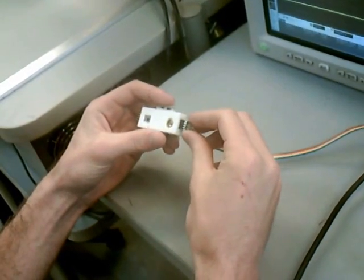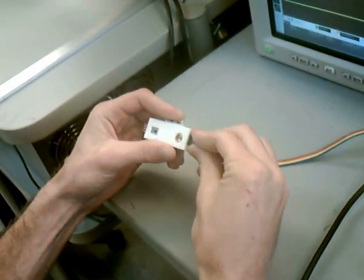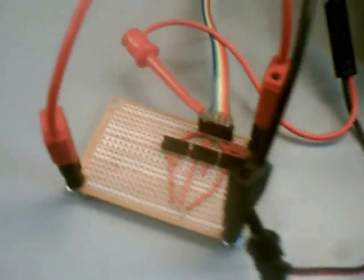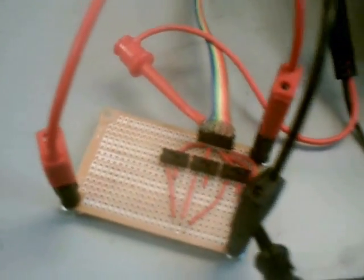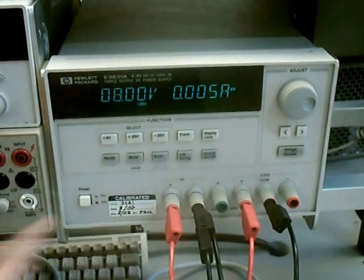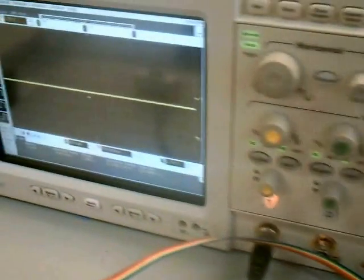The basic test setup and proof of concept has been completed to show that the module is able to detect changes in oxygen levels in the blood. The wavelengths are controlled by this simple switchboard, which also supplies power to the photodetector. The power supply is adjusted to provide a constant 5 volts to the photodetector and is used as a constant current source to provide 50 milliamps to any of the three LEDs, which have different operating voltages. The output of the photodetector is amplified with gains between 2 and 20, depending on the test subject, so that small changes in voltage can be monitored. This signal can be viewed on an oscilloscope or using LabVIEW.